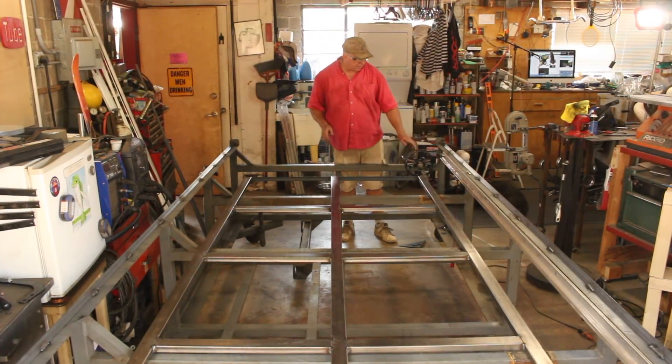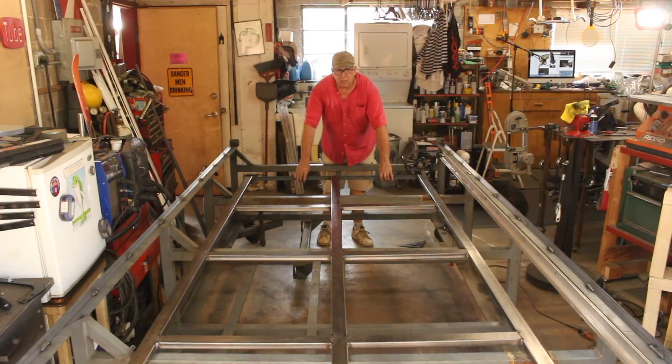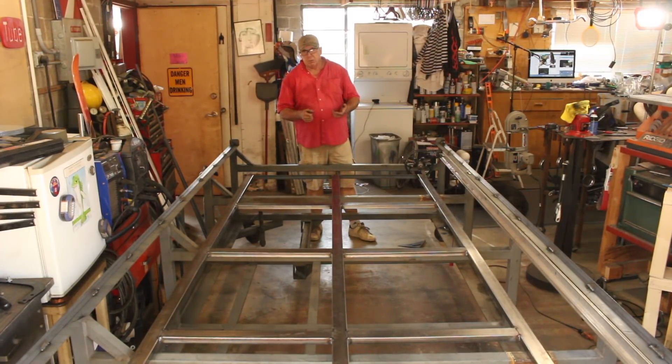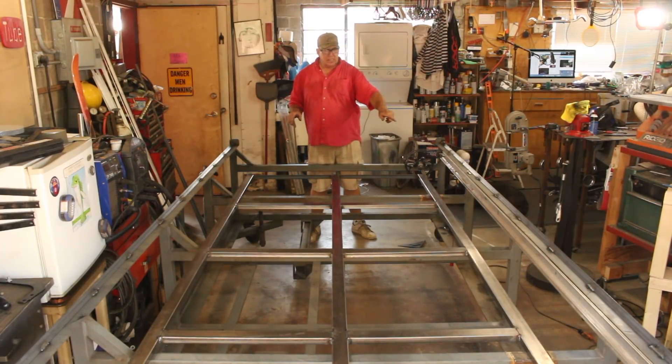Progress is pretty good. I've got my linear drive and a nice big flat table. Now what I need to do is put this table on some sort of linkage so it will move up and down, then put some sort of jacking screw under it to accomplish that movement. After that we'll install the gantry, link it to the linear drive, and figure out some way to clamp the piece of wood in place on this table.